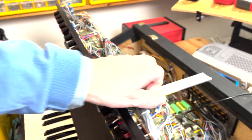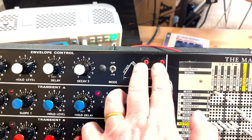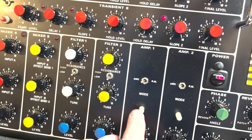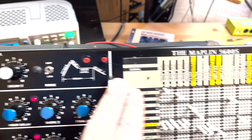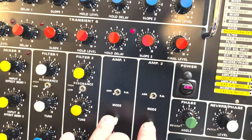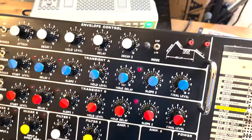The VCAs are kind of tricky — I've moved the trimmer so I can reach it from the front panel. When you have different loads on the control input they start to drift and make noise. It's really convenient having these trimmers accessible from the front panel, and I'm going to demonstrate that for you.